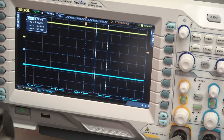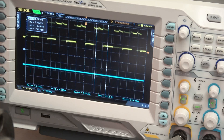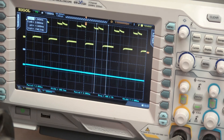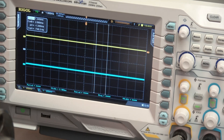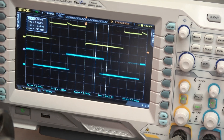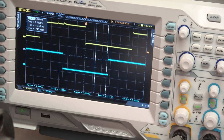Actually, maybe I'll put the scope on it first. I've put it on pin 4 from the scale — that's the blue trace — and I only see some spiking, which would be expected on an un-terminated line. Now I'll connect the scope probe to pin 4 from the DRO and see what's there. There's some signal coming out of pin 4 — the blue trace — representing a signal coming out of the DRO, which Eason says is ground. Something funny is going on.